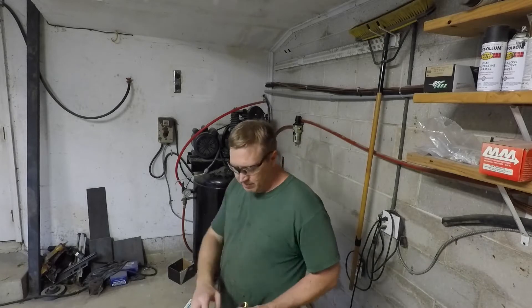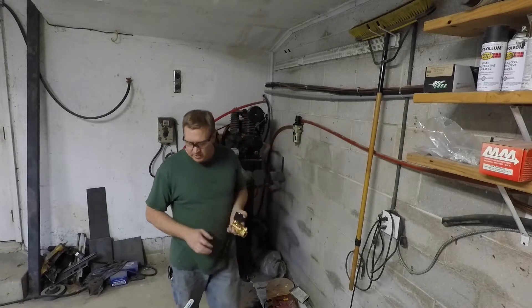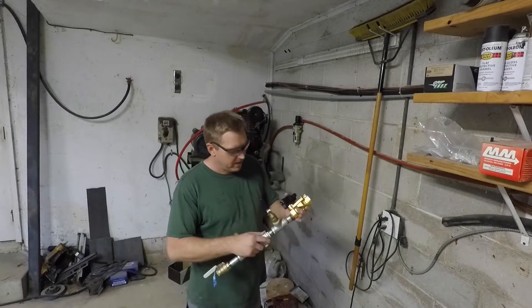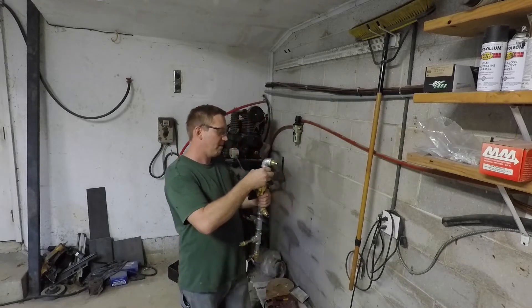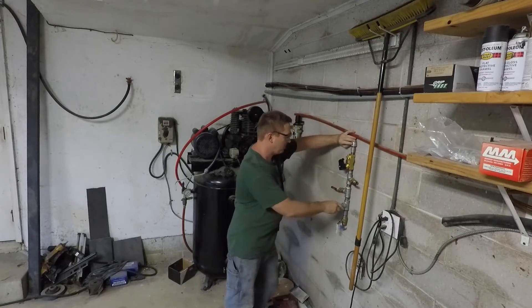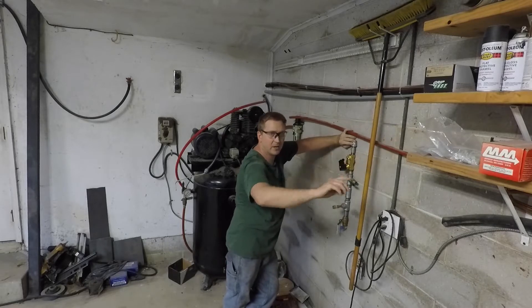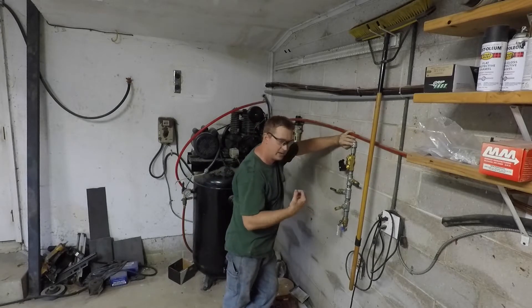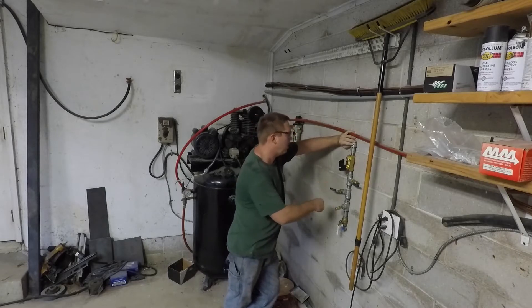This thing does want a big air filter in place — this is a 300 cubic foot air filter right here, set up upstream of the valve. They also tell you to mount this vertically so that you don't get crap stuck inside the valve and it will always dump out. I've got to finish putting it together on this manifold. I've got a valve for my lines going out to the shop, a load line that goes all the way down to my sheds — buried underground, about 250 feet — air out here for blowing up a tire, and an empty valve on the end to drain any water in the manifold column.